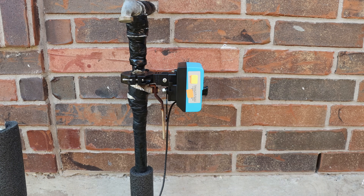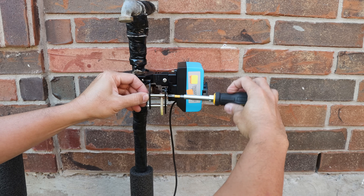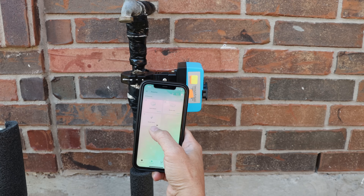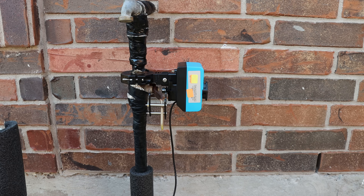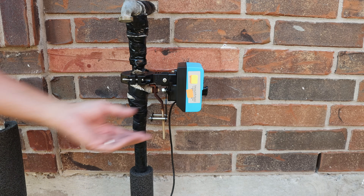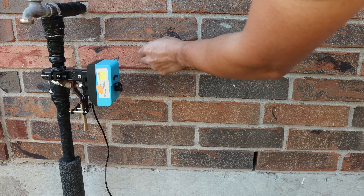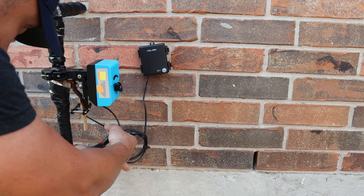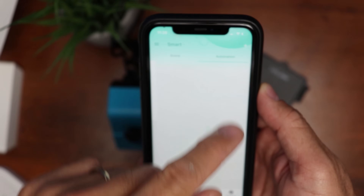Slide in the Bulldog valve unit into the bracket slot and screw it in with the included machine screw and tighten. My water valve is in the open position. Attach the support bracket using the pin screws, making sure they are against the valve handle. You might need to readjust and tighten when the valve is open and also when it is closed. Let's try this from the app — open it up. That should work. You can install the valve controller nearby; I just drilled a hole for a plastic anchor to screw it into my brick wall, then used zip ties to tidy up the wires.